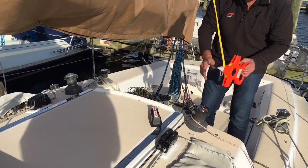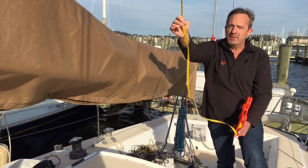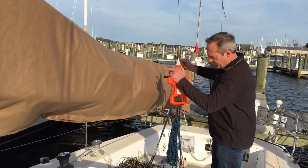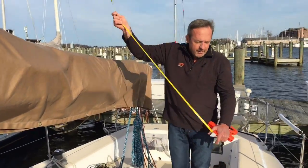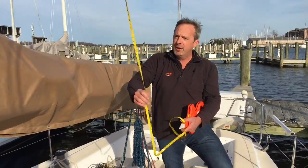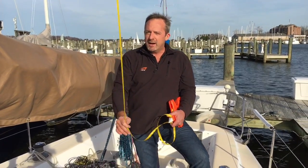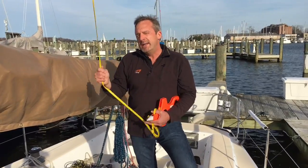Once I'm there, I'm going to clutch or cleat it off. Now, I'd be tempted to just take this up to where I would attach it to the mainsail and say that's the length — but that's not necessarily the case because this has dual purposes. This main halyard could be a topping lift for the boom. If that were the case, I would put the boom down on the deck and bring this back to measure to the end of the boom, which is going to be longer than just attaching it to the mainsail. On a cruising boat, I might be storing my main halyard over here so it doesn't bash on the mast and make noise. For a jib halyard, I would not measure it just to the head of the jib on the deck — maybe I store it down on a pad eye even lower, or I use that halyard as a lift for my dinghy through a whisker pole. So think about the longest extension of the working end of that halyard.